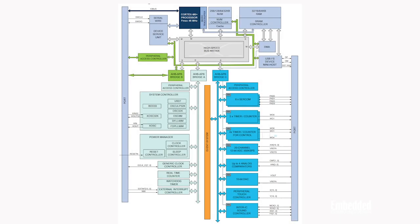Also onboard the MKR Wi-Fi 1010 is the Microchip SAMD21 microcontroller, which is based on a low-power, 32-bit ARM Cortex-M0+ CPU running at 48 MHz. This little SAM includes a single-cycle hardware multiplier for a little extra oomph, as well as a micro-trace buffer that is super helpful when you're debugging, as it tracks what code has been executed on the device thus far.